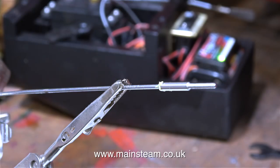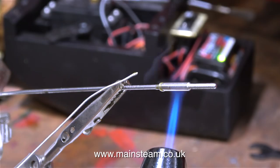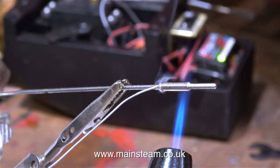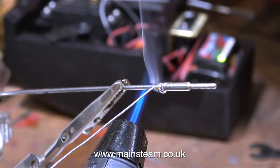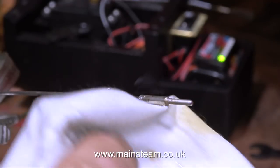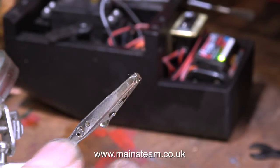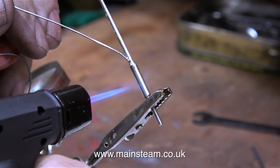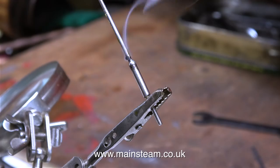Now it's time to repeat the process — this time I'm going to solder another one of these fittings onto a piece of wire and this will operate the regulator. I'm using a small Chinese blowtorch for this and it generates more than enough heat to do this job. In fact I'm being very careful not to get the part too hot. I could silver solder this component but it really is not necessary, and it's not a good idea to overheat the wire. I once did silver solder one of these fittings onto a piece of piano wire but it became very brittle and broke easily, and that's why I stick to soft solder. It's more than strong enough in this application, but you need to make sure that you have a really good joint — if the solder does not flow the part will look like it's stuck to the wire but is likely to come off in service. And here's the finished linkage for the regulator.